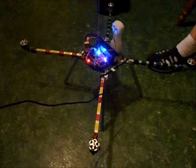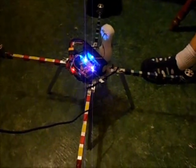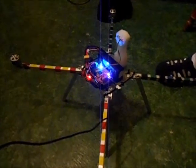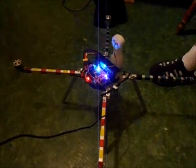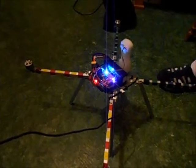There's the motor spinning up — clockwise — and it's going the same way. All my motors are spinning in the same direction, and that's not what I want. I want clockwise and counterclockwise alternating, so I'm going to have to fix that by reversing some wires.